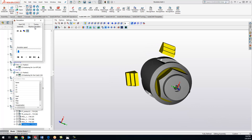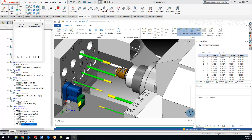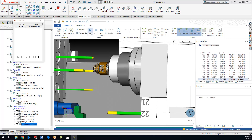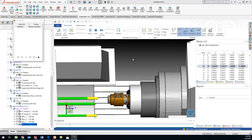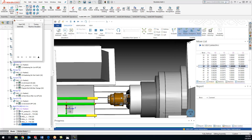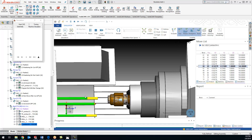Let's go ahead and do a machine sim. Now in our machine sim, playing through with a straight-down shot - slowed down - you'll see that our spindle is actually turning and it's machining the hex that way. This takes out the movement of the gang tooling and can help you guys out with space if you don't have enough room. You've got a couple different ways of going about it.